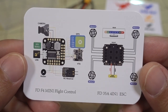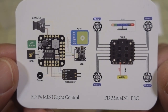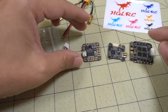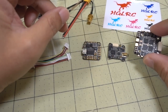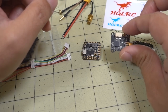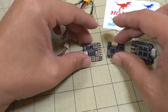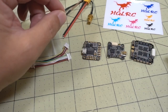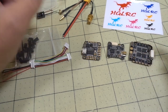There's a wiring diagram for the flight controller and the 4-in-1 ESC. The voltage ranges are a little different across components: the flight controller handles 2–6S, the 4-in-1 ESC handles 3–6S, and the video transmitter runs 7–26 volts. So 3–6S is probably the best range for all three. You can't do 2S on this ESC.